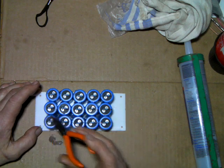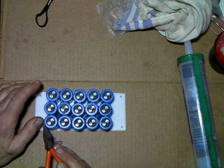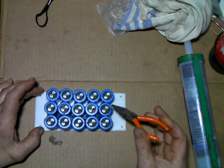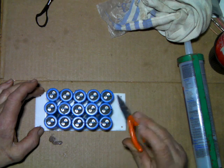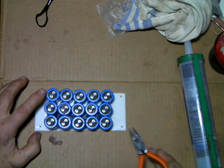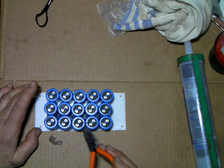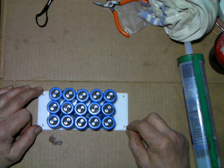You're going to keep it in series. If this is your start end, you've got negative here. You're going to go across to the positive of that cap and then continue on — when you get to the next point, you're still in series, so connect that and keep on going. This would be ground on the negative end — that's your ground wire — and this would be your high voltage end. Thanks for watching, see you in the next video.